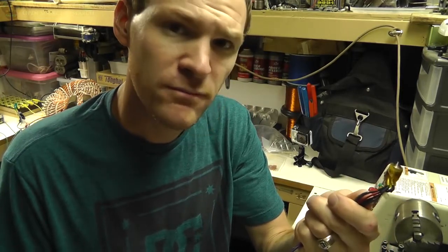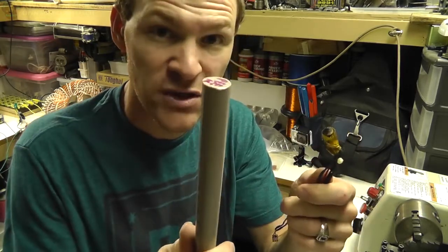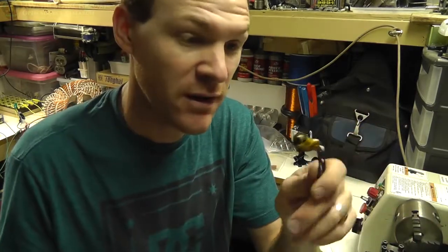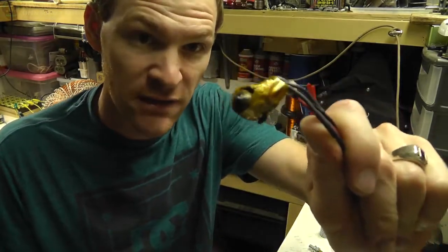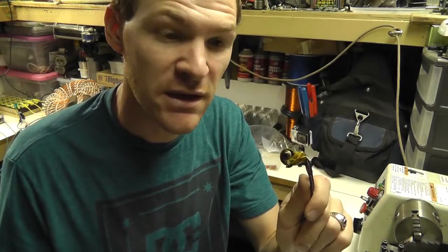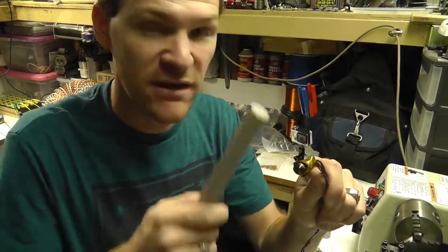So what are we going to do? The goals are make it out of PEEK because I actually like it. The regular boring J Hotend from the original RepRap actually works really well, and make it a pretty high wattage heater and make it wrap around this guy like this. And then I'm also going to make it so I can thread something into the bottom. It needs to be that way so I can thread a new tip into it without messing everything else up.